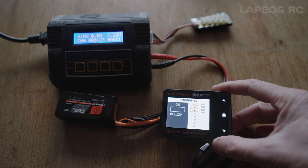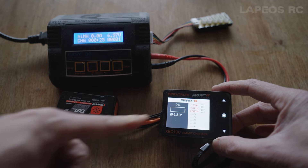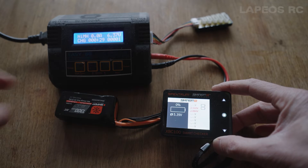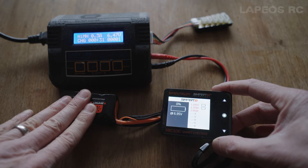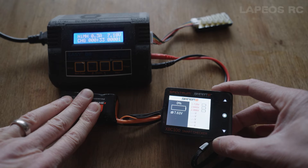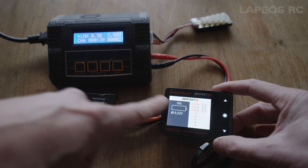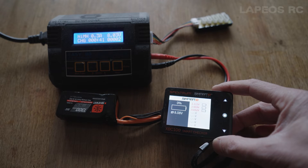I just have to let this one charge for a bit. The trick is to get the voltage on the first cell up to at least three volts — right now it's like zero. I'm just checking so that the battery doesn't become warm. Slowly this voltage will rise; right now it's above two volts at least.